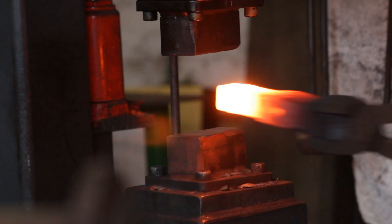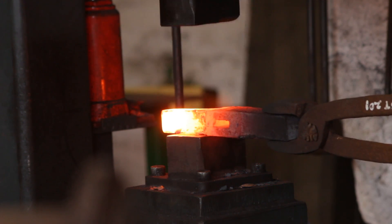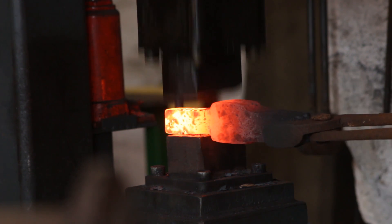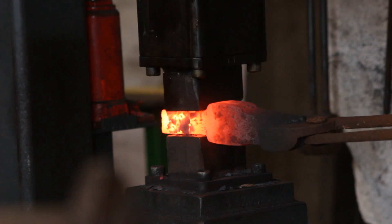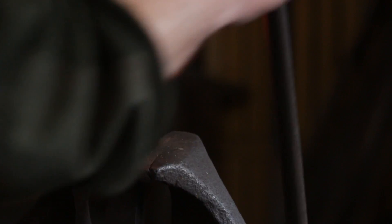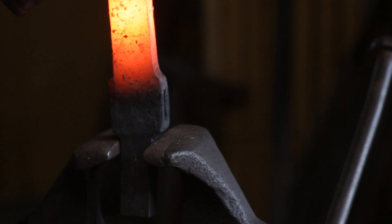At this stage I will just kiss it with the power hammer — that is to blend in those weld lines a little bit. I didn't put a massive amount of effort into blending the weld lines in, not like I normally do, and that's because I want it to be actually visible that it does have a high carbon steel face welded onto the wrought iron body. I'm basically just squaring it and getting everything a nice even dimension. The next thing I will do is, having quenched off the eye so that I don't get any distortion in there, take my sharp chisel and start cutting a v-groove into the axe section.